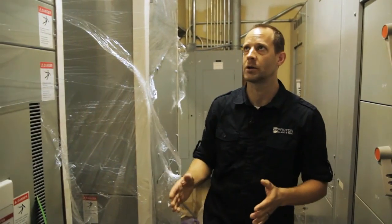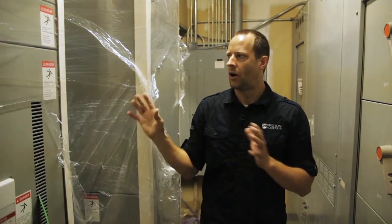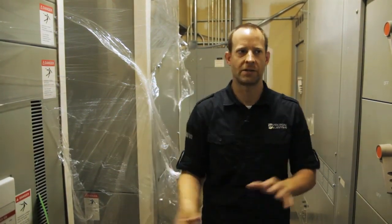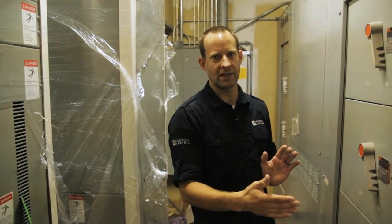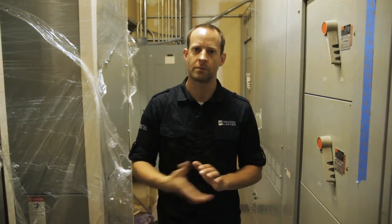The new equipment over here on my right hand side is a lot smaller. It's about the same height, so what we're going to have to do is fit three panels into an area where four used to exist. So we're going to have to do some cutting and fitting, and then at the end of the night or early morning, we'll turn it on and they'll have a brand new power distribution system.